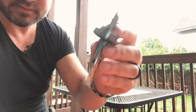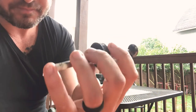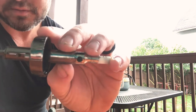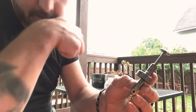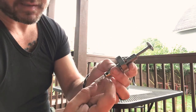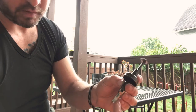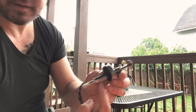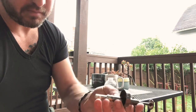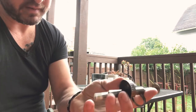You'll notice there's a little bearing in there — you can hear it. If you play around with it and roll it around, you can actually see it in that hole. There's a little bearing that rolls around. The problem with ours was that that bearing was stuck. It's supposed to sit in there — what it does is stop the water from coming back out the bottom. The water goes up when you pump it into this area, but then the bearing falls down and prevents the water from coming back out. You can see how when I was rolling it, the water just kept coming out because the bearing was moving.